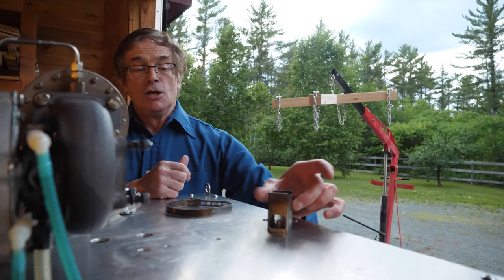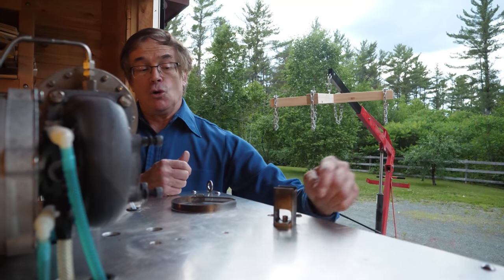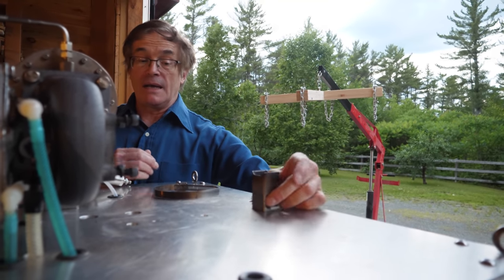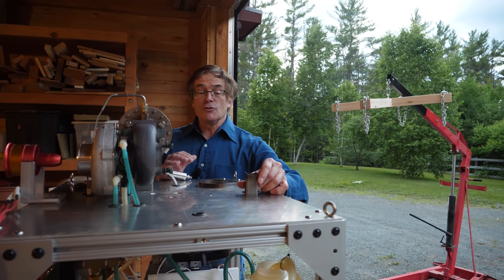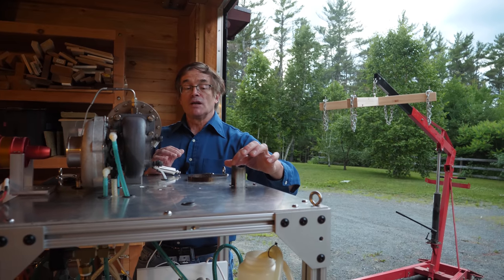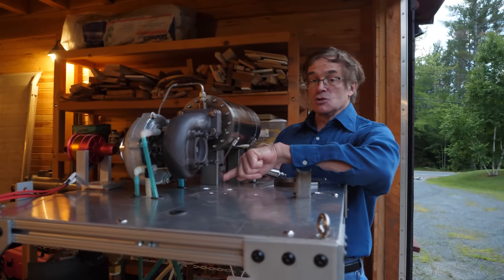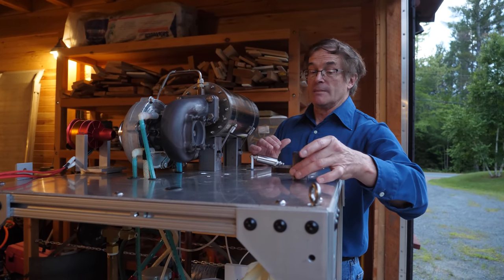On the sides I drilled a hole, squared them up with a file, to accept a little bar with a hole drilled in the middle of it. That's used to clamp with a screw and a nut underneath, and you can locate the support point at any point on the stand — it's arbitrary and flexible; you can move it around by just drilling a different hole. The other advantage is that because the tube only contacts at these very fine, thin lines, there's very little thermal contact. So even though the end gets very hot, during operation I can put my finger at the bottom surface and it becomes noticeably warm but transfers very little heat to the underlying plate. This is cheap, easy, and very flexible — a nice way to mount this.